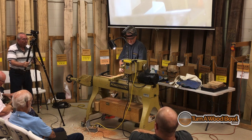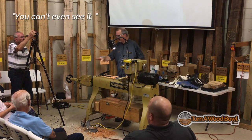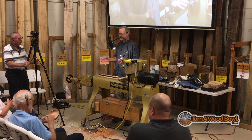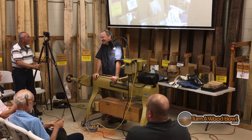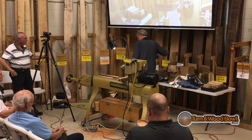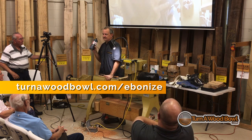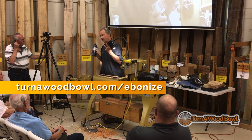The next technique — when I learned this, I kind of hesitated because it sounded so obvious and boring, but believe it or not, India ink is actually a really cool technique. You only want to use one kind: Speedball Super Black India Ink. The reason is that other India inks on the market aren't all waterproof, archival, or UV resistant — this one is. The way it achieves that is there's actually shellac in the formula, so you're applying a finish on the bowl at the same time.